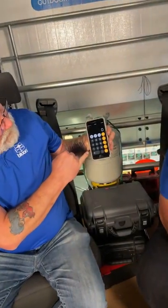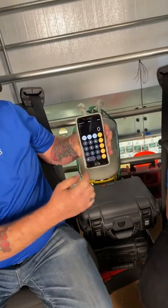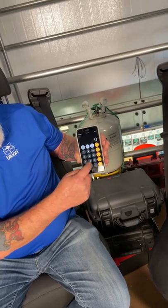The nine-lead motor allows you to change wiring from 230 to 460 volts. Here's a pocket trick using a calculator on your phone. For high voltage: wire 4 to 7, 5 to 8, 6 to 9 together, and power goes to 1, 2, and 3. For low voltage: 4, 5, 6 get tied together; 1 goes to 7, 2 goes to 8, 3 goes to 9 — that's where you hook up your power leads.